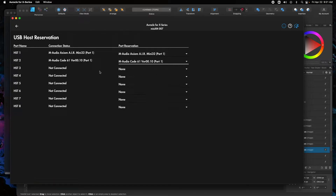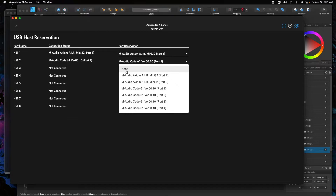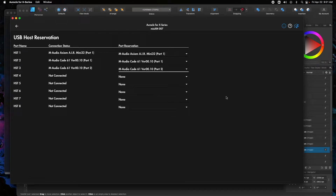I had an example specifically yesterday where we had an Alesis keyboard where they wanted to use the transport controls, and the transport controls were actually on a second port. So I'm going to mimic that type of setup since I have multiple ports on these keyboards. I believe my Code 61 also has some different functions on that second port as well. So I'm going to show you how to set up three ports to go to both computers.